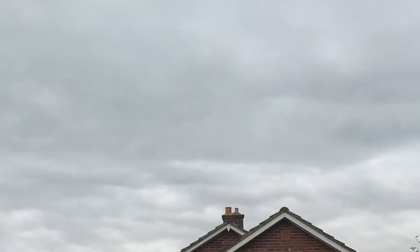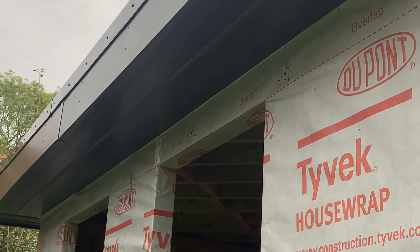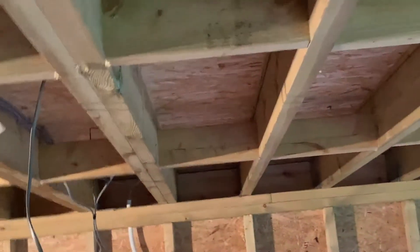Once they're all on, I just trimmed off the front to get the right length. That means, for example, this first joist's furrings will probably be going from about 50mm down to zero. Then as we go along, this joist here is probably going from about 70mm down to zero, until we get to the longest joists at the end, which are going from about 90mm right the way down to zero.